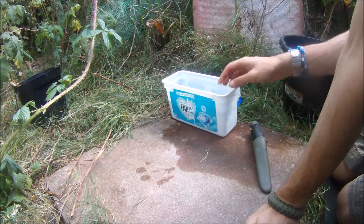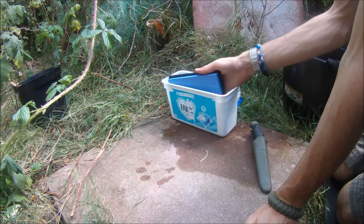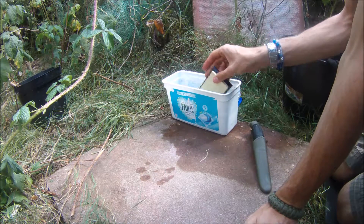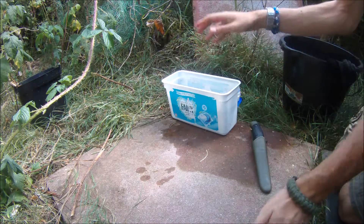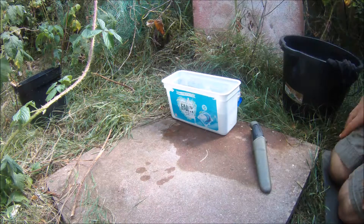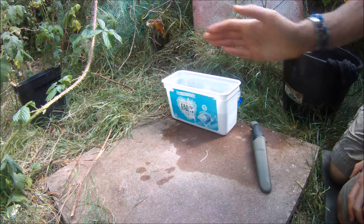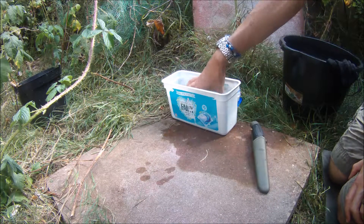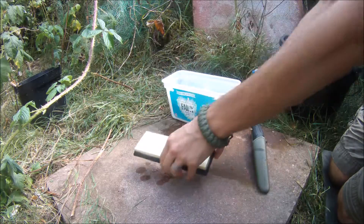So it's been about 15 minutes. I have different grits: I have a 600 — that's my coarsest — then a 1000, and then a 3000. You can go even finer than that, 6000 or whatever. Obviously the finer the stone you end up with, the sharper your blade will actually be. As it is not completely blunt, I'll start off with the 1000 grit.